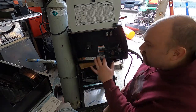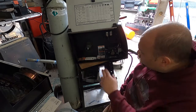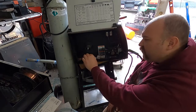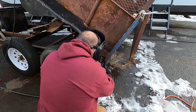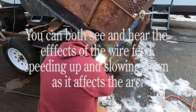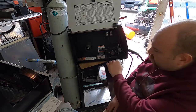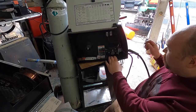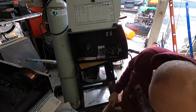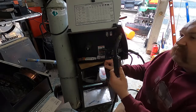So what was happening with this welder in my last video — this is your drive wheel and it was spinning just fine, but for some reason the wire was jerking. When the wire jerks as it's coming off, it probably means it's hitting some interference in your liner on your torch, your gun, whatever you call it.